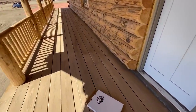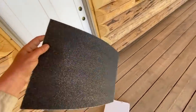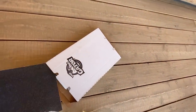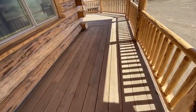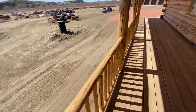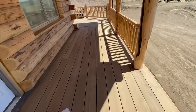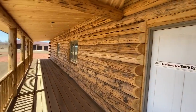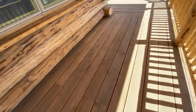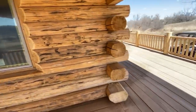This porch has been sanded, and David's finishing up the other porch. I prefer a 36-grit sandpaper — it's pretty rough. We give the porch a light kiss with that sander, and it takes off the slivers and rough parts, makes it a little smoother but still has a rustic look. Right now it looks dark because it's pretty dirty from last fall and winter — people tracked mud in onto the porch. But after sanding, we're going to apply the cleaner solution with the pressure washer, rinse from top to bottom, and it'll turn kind of golden and be ready for staining. We got the other side of the house cleaned off and will finish up the sanding.